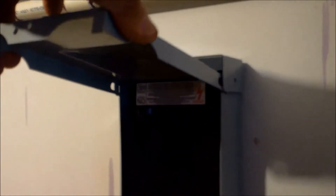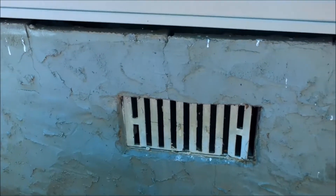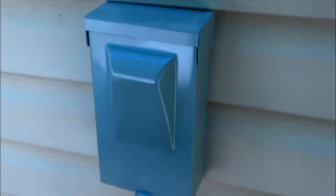I got my emergency shutoff wired here so the HVAC workers can work on it safely. You pull out the fuse — well, it's not really a fuse, it's just an on/off disconnect. That wire goes all the way up to the attic and to the fuse box. I've got one out here right below the slab with easy access to run my line set through.